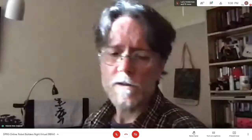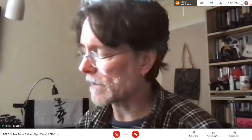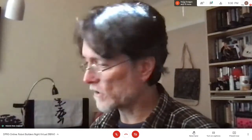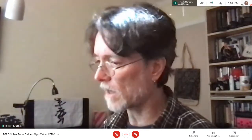Well, I think as I reported last week, I've given up on the club robot idea. So I've been refocusing on getting my robot running again, and that comes down to software. I have actually got a largely functioning message bus finally. It seems to work, and what I'm doing now is trying to reconnect it because it's all mocked. I'm trying to reconnect it first with my gamepad. It's basically a publish-subscribe model. The publishers are the things that generate events, like the sensors, and the subscribers would be like the controller, which runs behaviors, which then talk to the motor controller. So that's what I'm starting to do now.